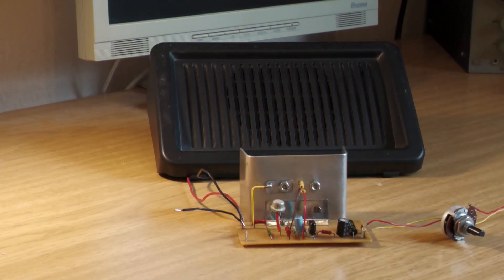And that is the result of this somewhat unusual project with semiconductor components up to 60 years old. I built the whole thing again on a universal circuit board, since it is not worth making a custom PCB for these power semiconductors. The heatsink is, as you can see, a little smaller. In about an hour of testing, it was shown that the heat development at the output transistor was not too great, so this smaller heatsink was fully sufficient. The amplifier can now be used for further experiments, and the full circuit diagram is to be found in the description below.